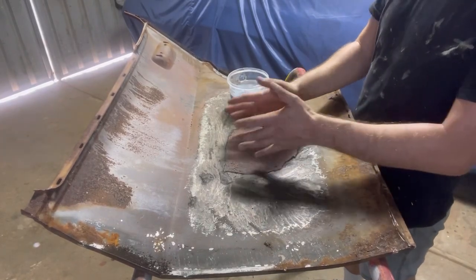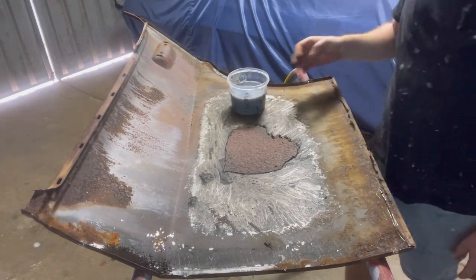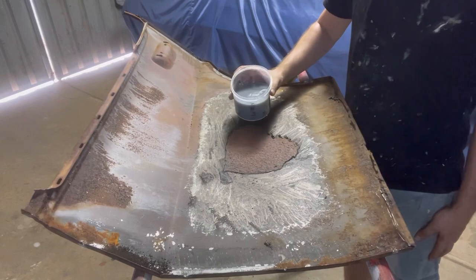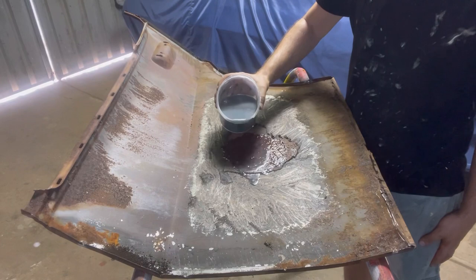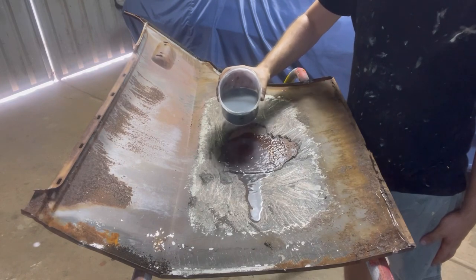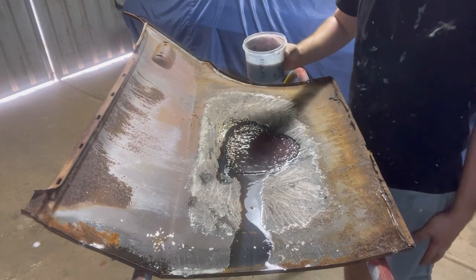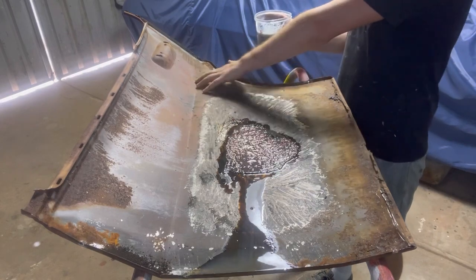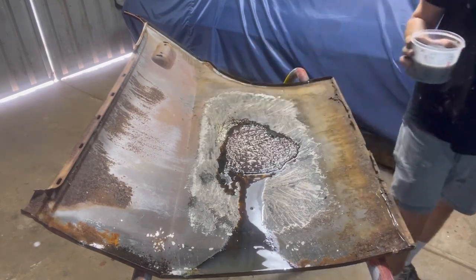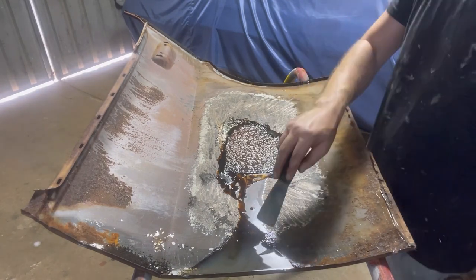Because it's in the middle of the door it's more accessible, so it's obviously going to be a little bit thicker. What I'm going to do is soften it up with a little bit of thinners — that's another reason why I keep this stuff. That'll bite in and make it a little bit easier to scrape, and I'll also use this to get rid of any of the old paint on the inside. As you can see it's already coming off.